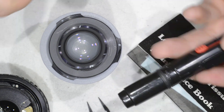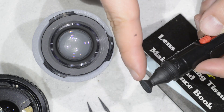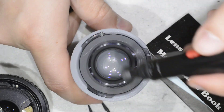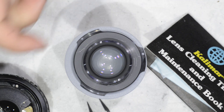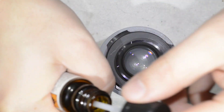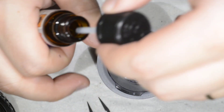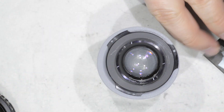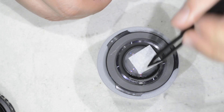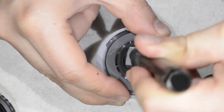The last thing I use is this — a lens pen. The reason I use it is that it allows me to push the paper well into the lens, as you will see immediately. If you want to get any of these things, you can find them in the description. Simple stuff: we apply the optical cleaning fluid, have to be quick because it evaporates rather fast, then put a piece of optical cleaning paper, come in with the lens pen, and do circular motions as you see here on video.